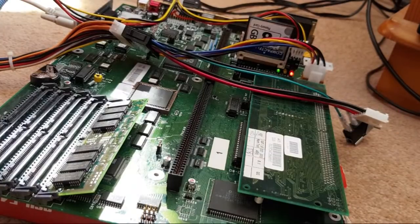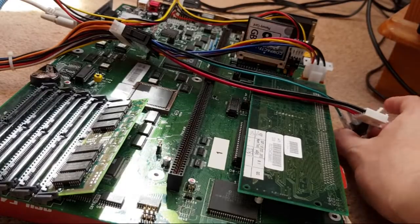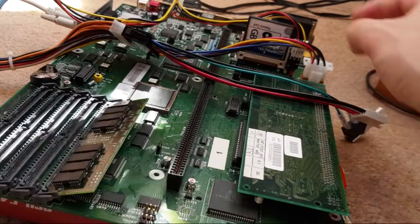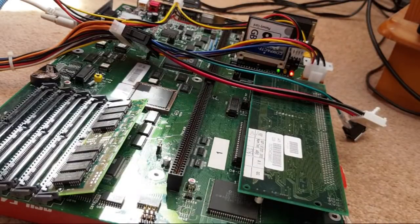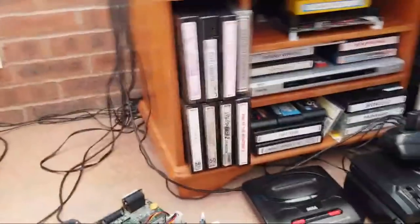Let's switch it on again. Yeah, it's booting already. That's flashing away there. Give it a second, you always get a pause there before it starts. Oh, hang on. Why is this now not booting? I don't like this. Has this one now turned into an A-hole as well? Sorry, I know the camera's at a crazy angle there. It's just to support the crazy behaviour. It's flashing there, look. Yeah, no, it's booting. I think the compact flash card just needs reseating, as you saw. Just reseated and it's started booting up.